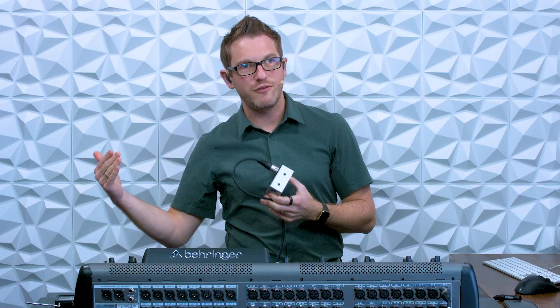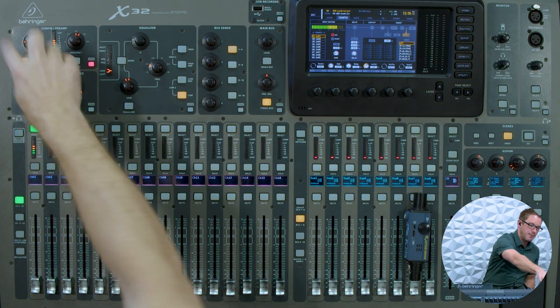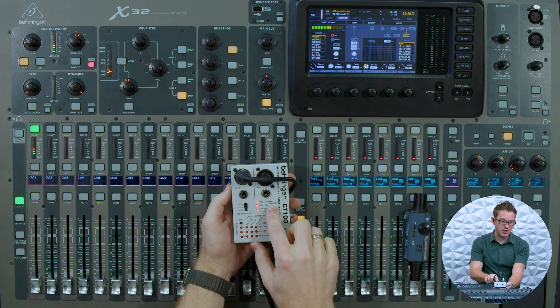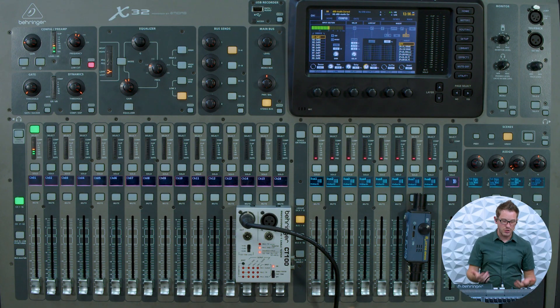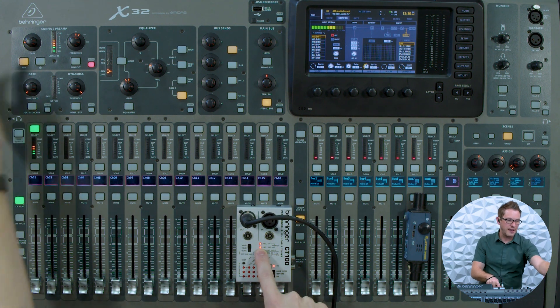The other benefit of this over a microphone is that you can test phantom power with it. With your cable, if you have your engineer apply phantom power, you can check to make sure that phantom power is working on your different inputs. Right here we can see pin 2 and pin 3 has phantom turned on. If I go and turn this off, it will basically not turn on these LEDs if phantom power is not turned on — so you can say hey, this microphone is supposed to have phantom power, go ahead and turn that on. Make sure that it is a condenser microphone or an active direct box that requires phantom power. Never turn on phantom power for a ribbon mic, as you might destroy it, and always check the manuals.